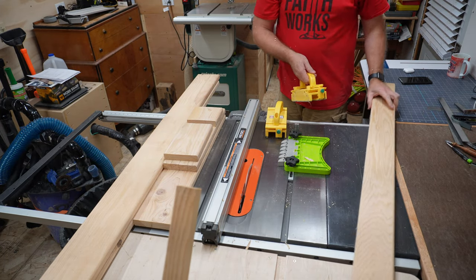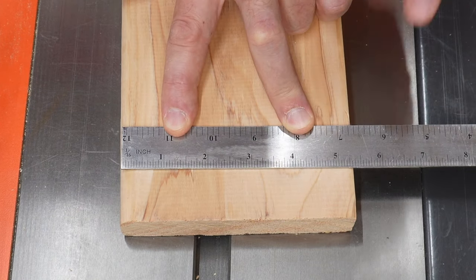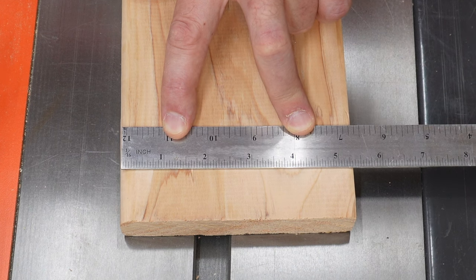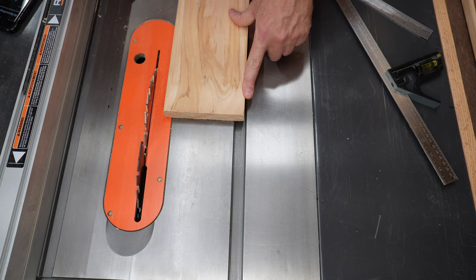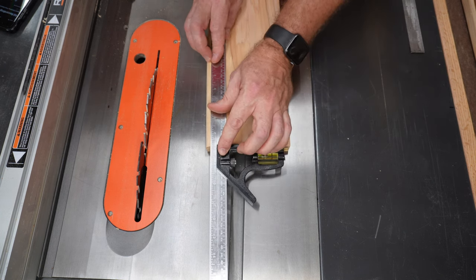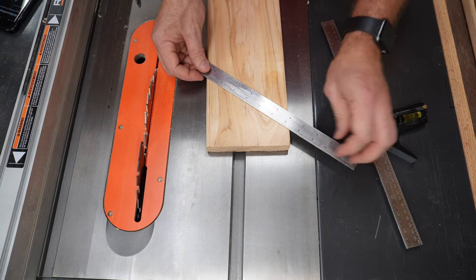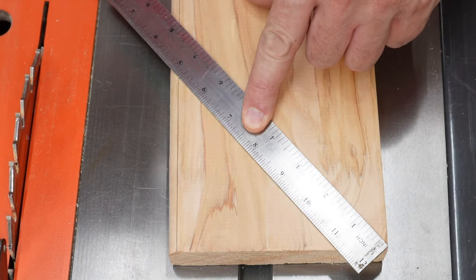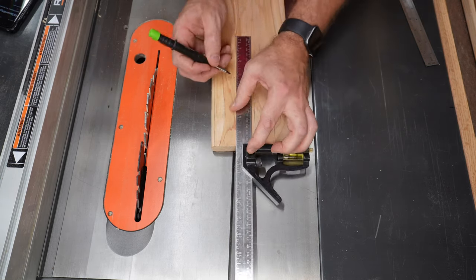Let me show you a neat little trick for dividing up a board without doing any math. If I were to rip these 5 and a half inch boards down into 1 and a half inches wide, I'd only be able to get 3 strips out of this board, and then I'd have a strip left over that I wouldn't be able to do anything with. So in order to maximize my material, I had to figure out a way to get the most number of slats that would still be able to slide over a dowel and not break. I know I can get 4 strips out of this board that will still be wide enough to fit over a 5/8-inch dowel. I've already cut off one rounded edge — that's important, do that first, otherwise you'll end up with one strip with a rounded edge and all the other ones with square edges. Next, draw a line on the opposite edge just inside that roundover. Then take your tape measure, or better yet a ruler, and find a number that's easily divisible by 4. In my case, that would be 8. Line up your rule diagonally from the outer edge to the line so that the 8 is on the line, then make a mark every 2 inches. Extend that line to the end of the board, and now your board is evenly divided into 4 sections.